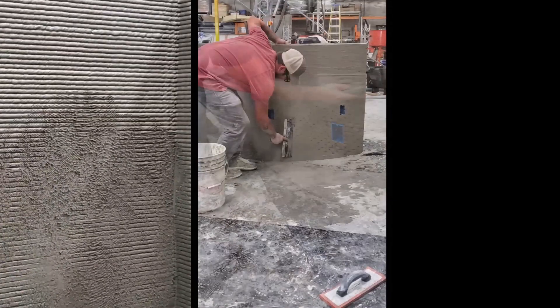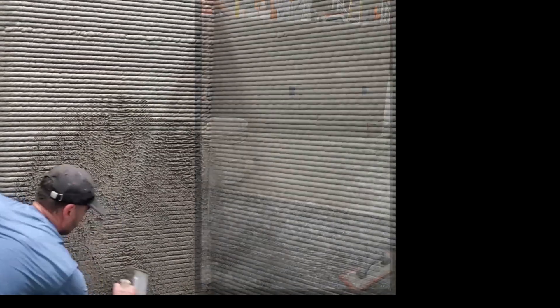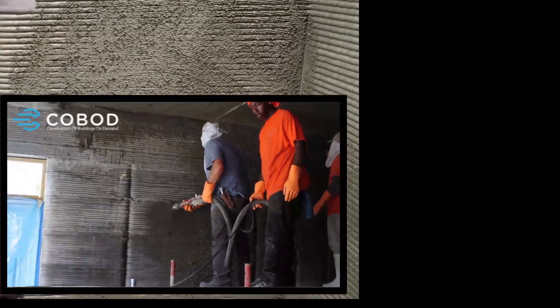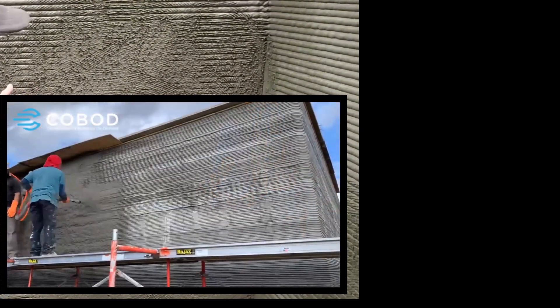Going right behind me. It's best if you do these circular motions. If you just go like this, you have a tendency to dig into the wall a little bit. I won't go up there yet because it was only 15 minutes ago — I'm not sending a plaster crew in blowing an inch of mud on the wall.